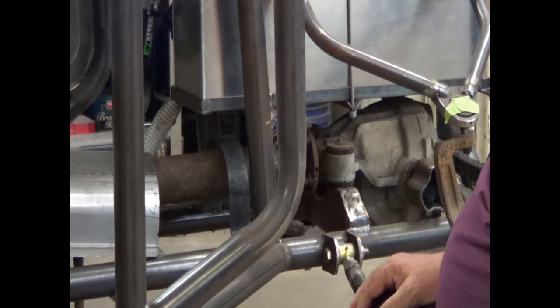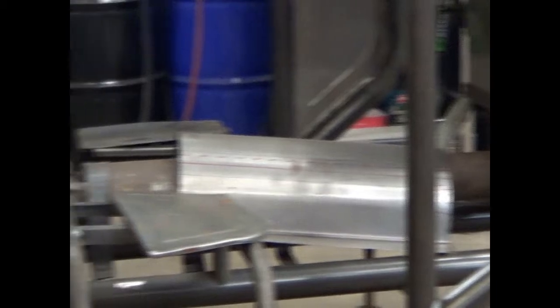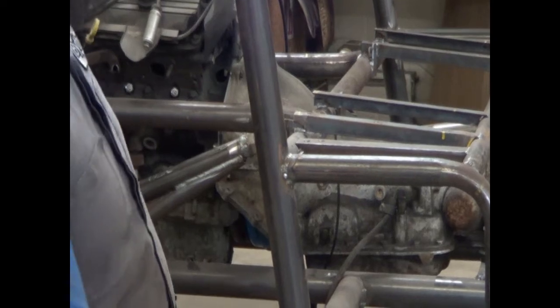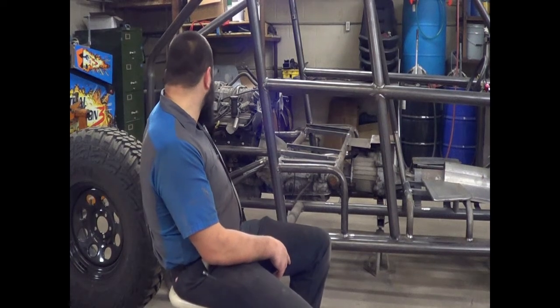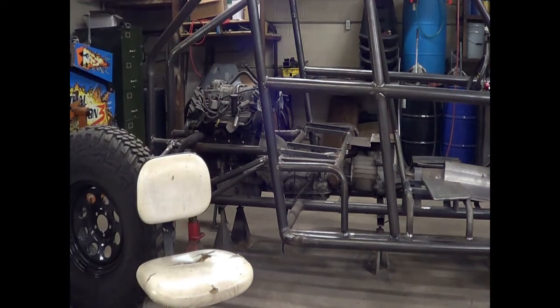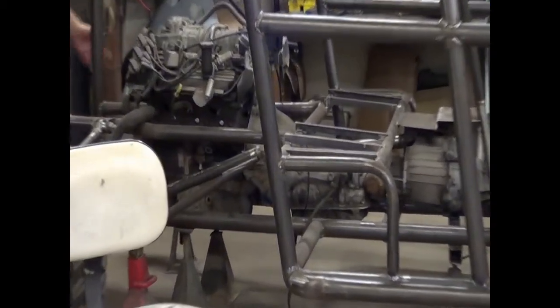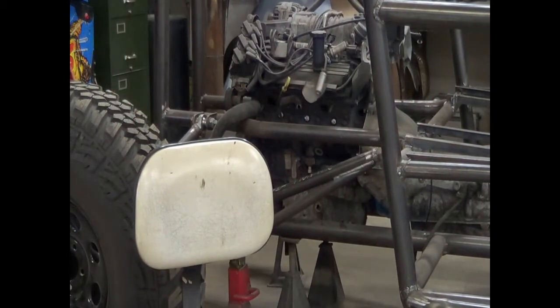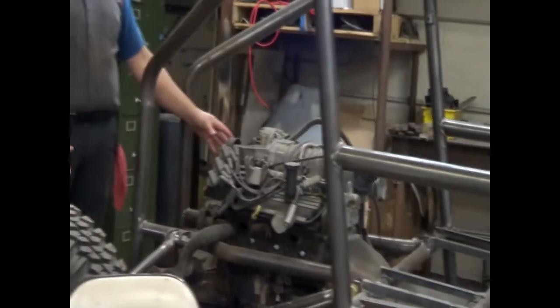The rear differential is the front differential out of a '95-ish Chevy 1500 pickup truck, again flipped upside down. That will be welded, so it'll be a Hobart locker in the rear. It'll be full-time lock, except they have a switch on the back of these differentials that disengages this wheel from the differential. So when you're running down the highway, you're not smoking tires, and you can steer. It's for whenever you're not running four-wheel drive, and it's in the original truck.